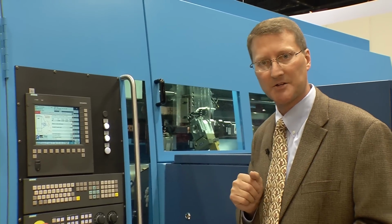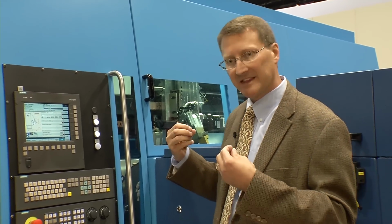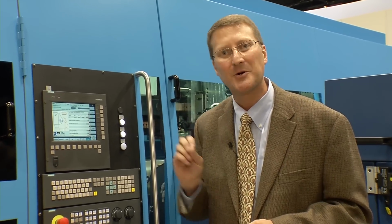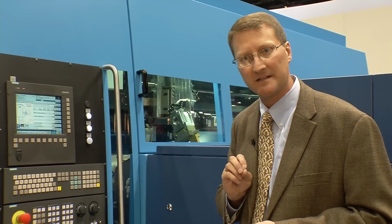After the part's finished, it's transferred into 100% length inspection, which is just on the outside of the light blue section. The length tolerance of a machined part is plus or minus 0.05 millimeters at 1.67 Cpk. Our standard deviation for length is generally around 0.02 millimeters. Very, very tight tolerances for very complex machining. All the parts are 100% checked for length.